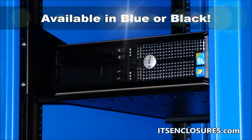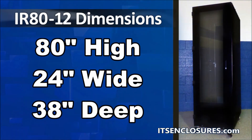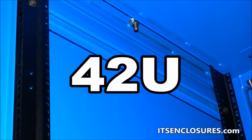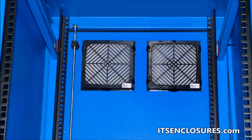The cabinet is designed to enclose rack-mounted electronics and measures 80 inches high by 24 inches wide by 38 inches deep. The IR-80 comes with 19-inch wide square punch rails and has 42U of interior space. The 19-inch rails are installed in the front and rear and are adjustable.